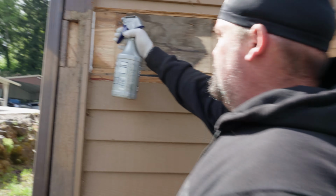There you go. And now you're left with a quarter inch bead and only a little bit of silicone on my finger. Okay? And it's not on my finger because it's on the glove. So that's how they suggest. That way, when this is cured, you have a nice protected bead of silicone left on the wall or on the siding. This obviously was just for demonstration purposes because we're going to cover that up with some deck boards and stuff. But I'm not going to start caulking the whole house up because then they'd have to paint that.